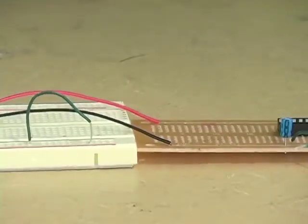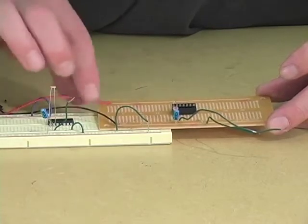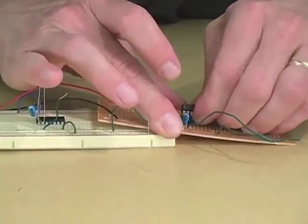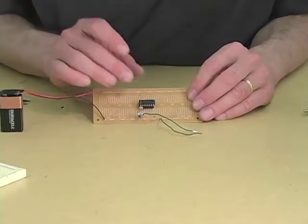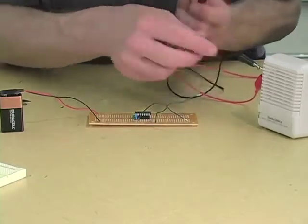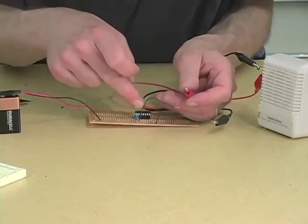Now we compare our two circuits side by side: capacitor, photoresistor, ground wire for the audio connection, output wire for the audio connection, ground of the battery, plus the battery. Looks pretty close. So we get ourselves a second chip and press it down into the socket. Make sure it's oriented the right direction with the notch in the front. Battery is hooked up, the chip is not getting hot, everything seems to be okay. Time has come to test it. Bring in your amplifier, connect the ground of the plug into your amp to the ground on your new circuit, and take the tip of the jack and connect it to the output of your circuit.